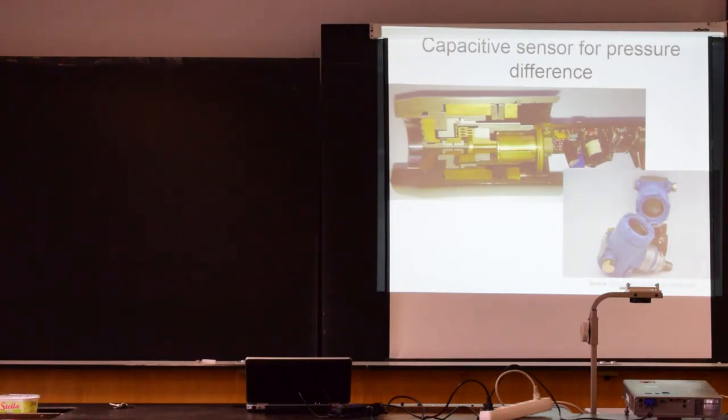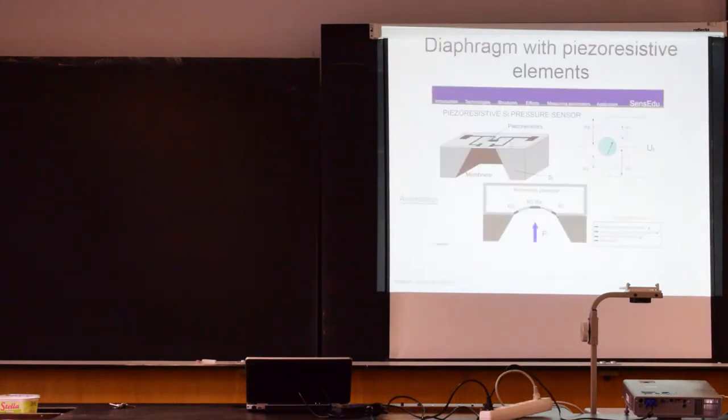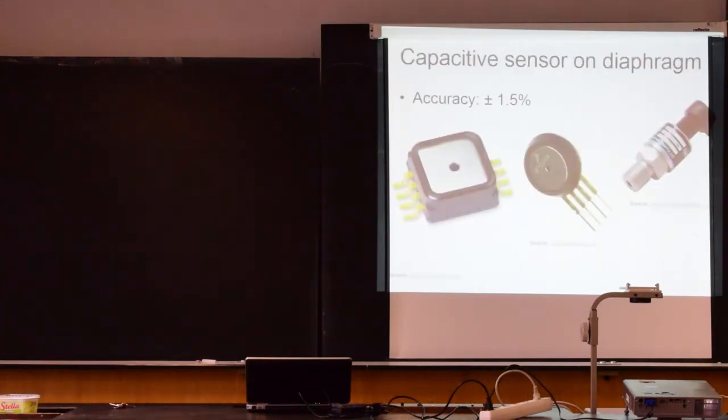So those are the industrial sensors. The chip itself that is using the silicon diaphragm typically looks like this. So here is the input port. Here inside you have this device, a chip with strain gauges integrated on the diaphragm from the backside, and you then have terminals that provide power supply, and you read the output signal from it.